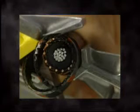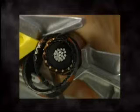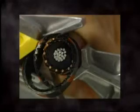After the second revolution, loosen then retighten the jaw locking screw. This will allow the tool's jaws to grip the cable with a tighter, firmer grip. For long stripping length operations, it is recommended to tape the neutrals down.